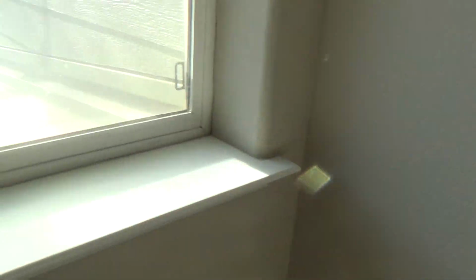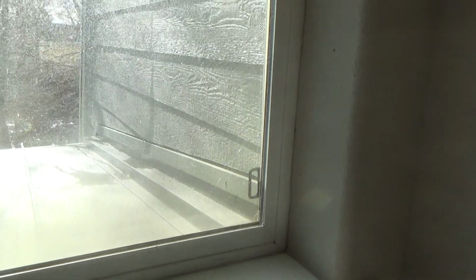Our walls are going to be slightly grayish, bluish. I think it's going to look good when it gets done, but I'm going to want to caulk this first, okay? So that the white edge is coming on the wall, I'll paint over, okay? And I'm going to look at all this. I've already, yeah, that one I got it scraped down here, okay? Far enough to where now a new nice little bead of caulking will finish that up.